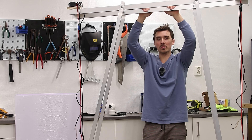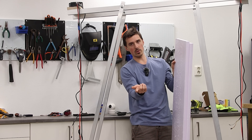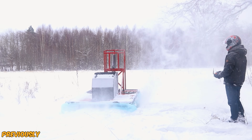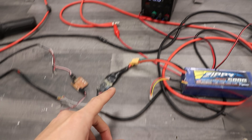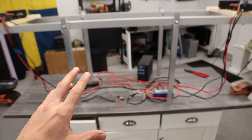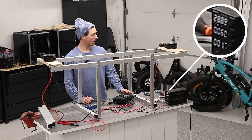New plan: cutting off the legs, making a safety box using XPS foam, and we might do some glass fibering with polyester just to increase the hardness. I spun up the motors to make sure they still work. The setup is a voltage regulator on the mains lead bumped to about 20 volts, going to a BEC and a modified servo tester — the servo tester handles the throttle. That should be the easiest way to control everything simultaneously. Let's go.